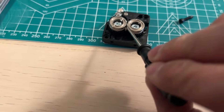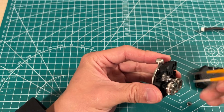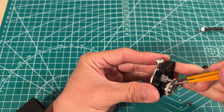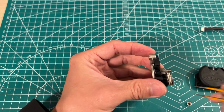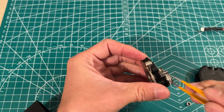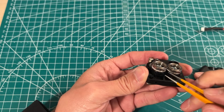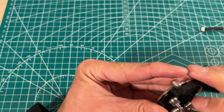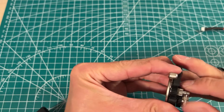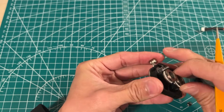So let's just remove it. Before you put it back, you also want to clean up the little teeth here, because after so many prints, the little grooves are filled with particles of filament, making them less powerful to bite on it. So just clean it out as best you can — it will give you a little bit more warranty before the next time you have to take it apart.